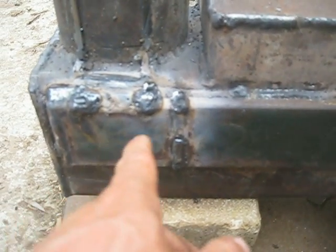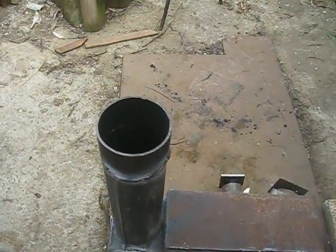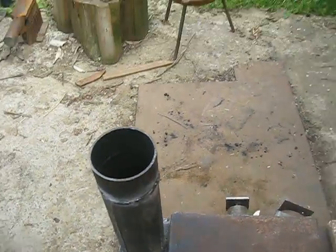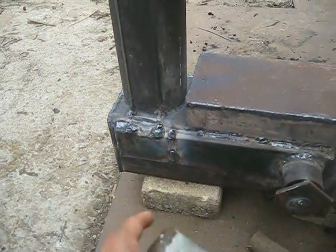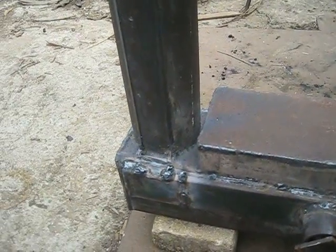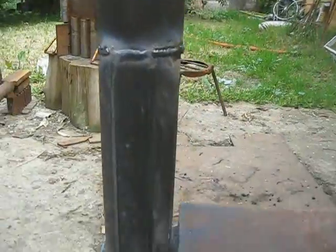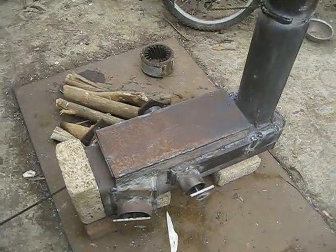The input of the secondary air is now in this area, more or less, and it's working fine. We can see the fire spinning down there, and there is not even a smell of smoke — whereas before there was a slight smell of smoke. Now you can see only heat waves coming out of the riser pipe. Thank you for watching.